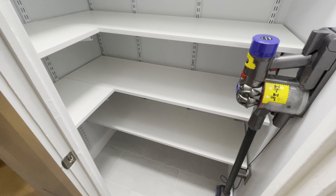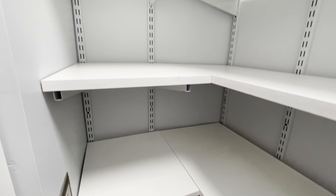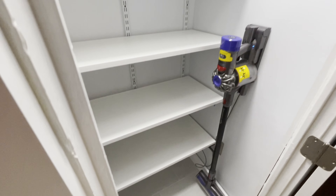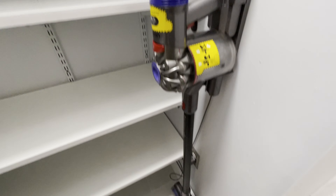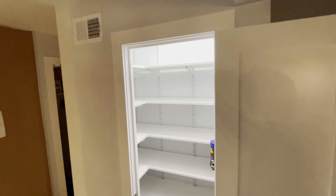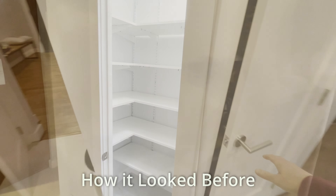I'm finally finished with this project. There's one spot with kind of a big gap that I have to work on a little later, but everything else is finally done. This took about two weeks to do — there was a lot of deconstruction, painting, drywalling, tile, getting it all together. But everything came out great. I'd say I tripled the space here now, and there are a lot deeper shelves. There's also the light switch for the light I put in there. All the L-shaped shelving is leveled out, everything's screwed in. This stuff is really strong — it's never going to collapse and it's adjustable. It's three-quarter-inch melamine particle board so it's going to be plenty strong. We may later need to adjust things, but we definitely ended up with a much better, much more usable pantry. I was happy that I finished this project.